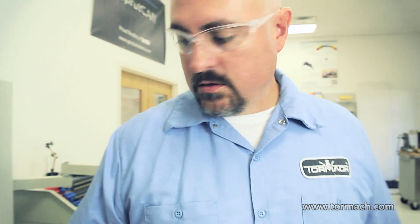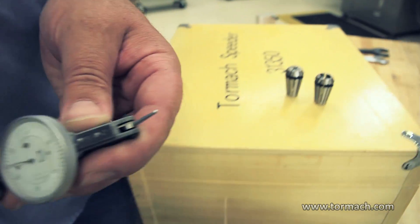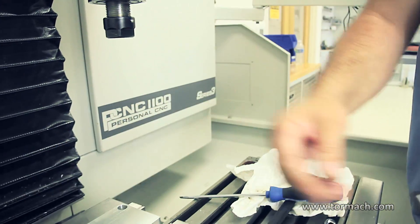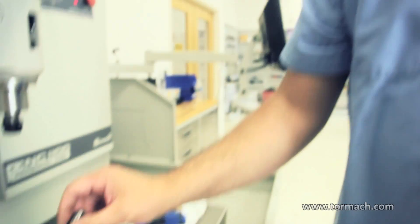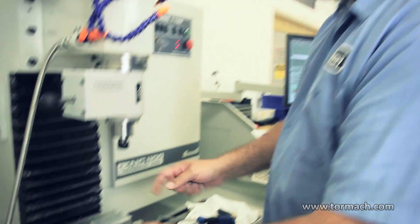There will be some misalignment. There are ER-16 collets that fit in the speeder, so you can get a 5/32 collet, put an indicator in the spindle, and just rotate it by hand to sweep a hole, or sweep the outside of the block. Put a 3/8 collet in here and use an edge finder if you have a 3/8-bodied edge finder. Just be aware: it's 3-to-1 output, so if you usually run your edge finder at 2,000 RPM, don't put 2,000 RPM in the machine controller — that's going to give you 6,000 at the speeder output and your edge finder may fall apart. I'll use the 5/32 collet and the indicator to sweep this hole for zero.